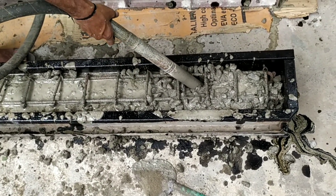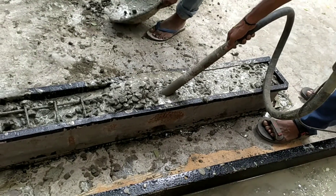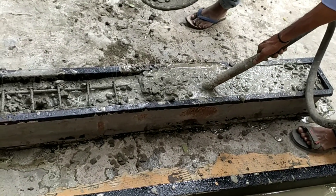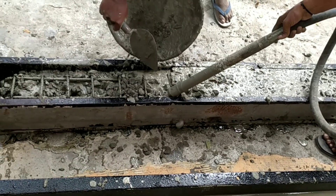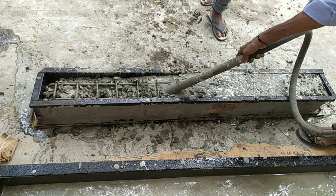Weak and stiff concrete means the general consistency is reduced with an increased water-cement ratio. The addition of more water gives a dilute paste which has more porosity at the micro level. This makes the concrete weak and results in shrinkage cracks and issues. The cement and aggregate particles absorb the excess water present in the concrete.